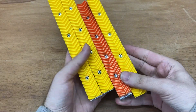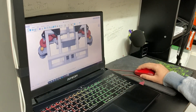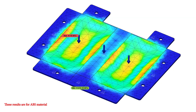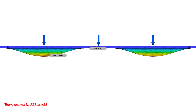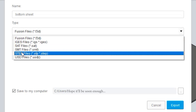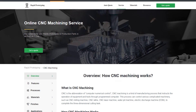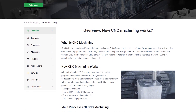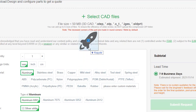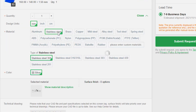I also prepared the racks. Now I need a plate to cover the press surface. I think PLA wouldn't be solid enough for these forces, so I should use steel sheets. But since I don't have CNC or steel cutting tools, the best solution is PCBWay. I use PCBWay's CNC machining services — I go to pcbway.com, upload the models, and choose stainless steel 304 material at 1.5mm thick for both parts.